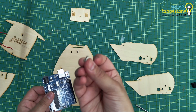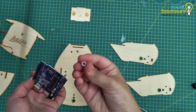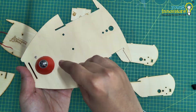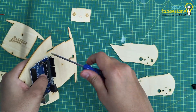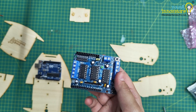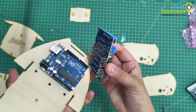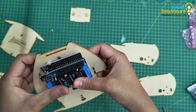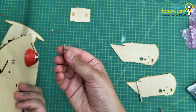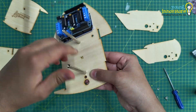Place the Arduino on the chassis. Use spacer pieces on each side, positioning them between the Arduino board and the chassis — this will allow the board to sit securely. Bolt the Arduino down properly to ensure it's attached tightly. Now place the motor driver shield on the Arduino. Line the analog and digital pins accordingly and gently press down until the shield is securely attached to the board. Now fix the metal spacers as shown in the video to secure the motor shield and help with mounting other components.